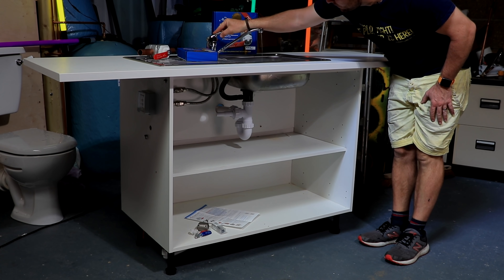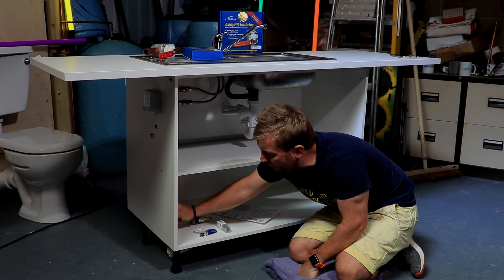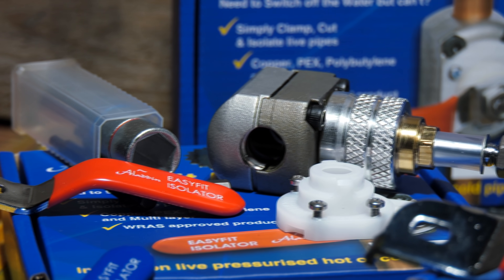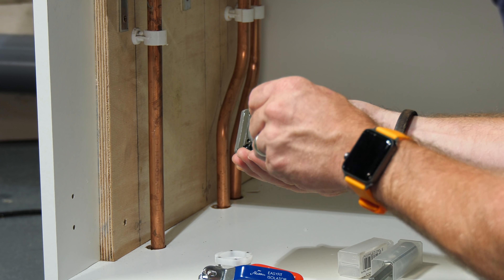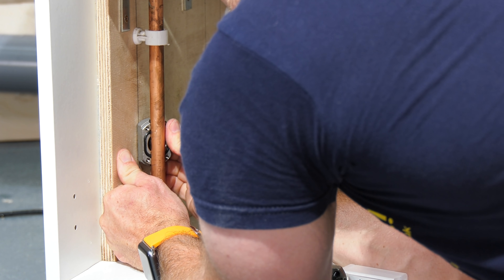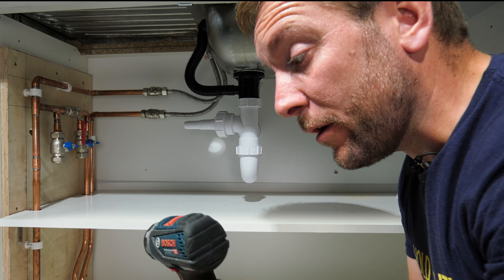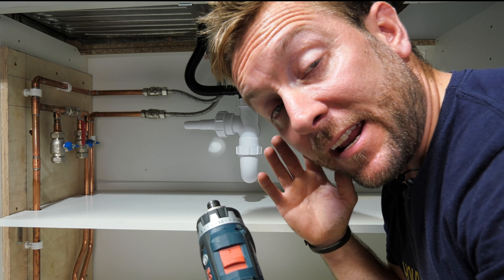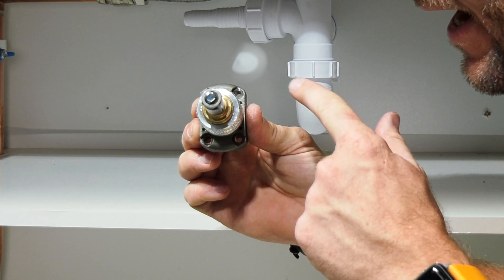Let's turn the water on. There we go, a little bit of water just coming through. First thing you want to do is just check the pipe and make sure you've got no scores in it — that goes for plastic pipe too, because these can fit on more than one type of pipe: copper, plastic pipe, barrier pipe. What we do first is undo each one of these allen keys and strip the bottom part of the housing away, because that's what we've got to get round the back of the pipe first. There we go, the bottom part of the housing is now off, so we just pop it round the back of the pipe and into position. Next, and very importantly, if you're using an impact driver or any drill, turn the torque to half its torque strength — we've got 20 as our main torque, so turn it down to 10. That's going to prevent us from shearing off any threads. We tighten up our screws in a certain way: one, two, three, and four, just like this.